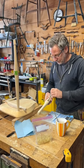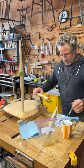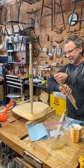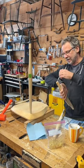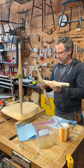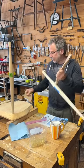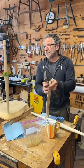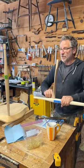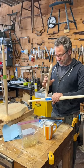So I'm going to put some glue in here, and I'm going to need my wedges. I'm going to glue this all the way around — just a real thin layer of glue. You don't have to goop it up too terribly much. Then I put this in here like this. Now some of you are going to be using wedges: this is a great time to drive a wedge in from the bottom. That will indeed make your joint really nice and tight.